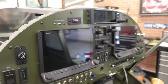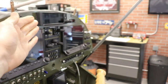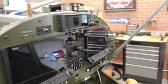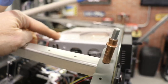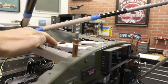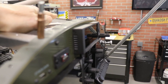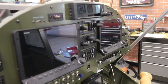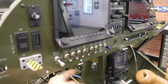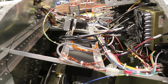The last example of thinking ahead is my GPS. My original plan was to mount a hinge on the bottom of the panel so the entire panel would fold down for access to the back. I did think ahead enough to realize that with this GPS mounted back here, as the panel rotates down the back of the GPS would come up and hit the top skin, preventing the panel from folding. That saved me from putting a hinge there when it really wouldn't work.